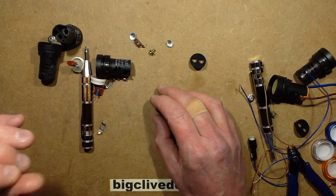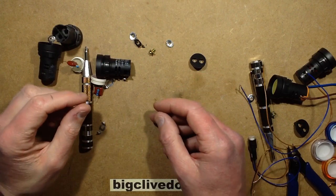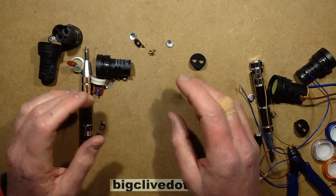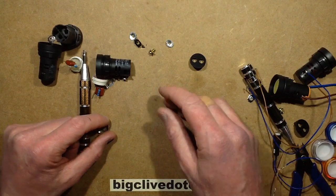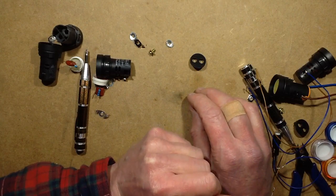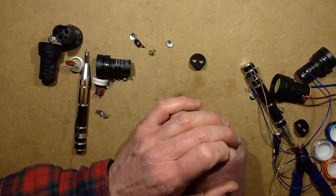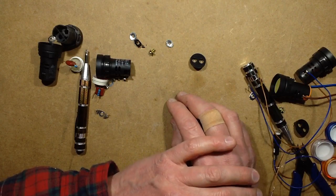And I get the feeling that maybe they'd done that because the lamps were failing so quickly, because the 240 volt lamps don't last very long. And they also tend to fail quite dramatically, sometimes taking the control circuit out too. And so boiler 1, boiler 2, had these little transformers at the bottom. Boiler 3 didn't have the transformer, it was just this 240 straight out to those connections. So the moral of the story there is just never assume, just because everything seems so obvious it's going to be low voltage, that's a good way to get a shock. If you just make the assumption that the third one is going to be the same as the others.